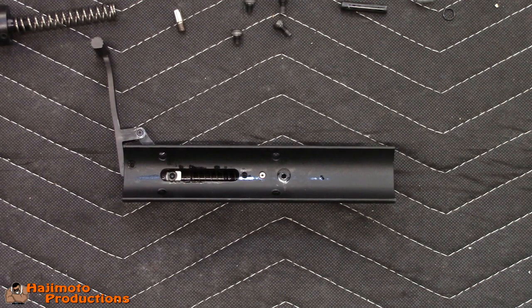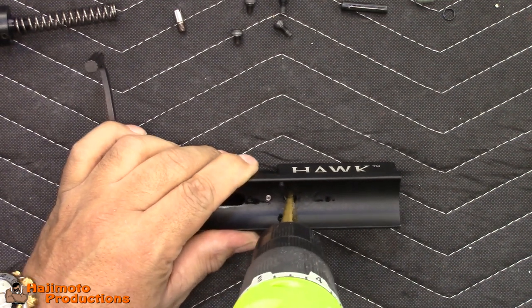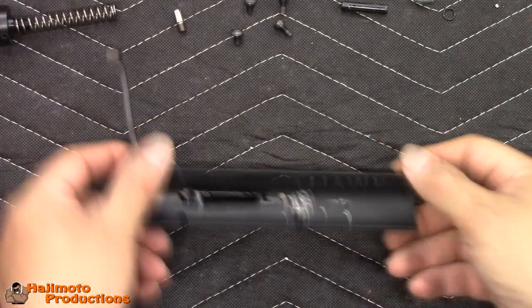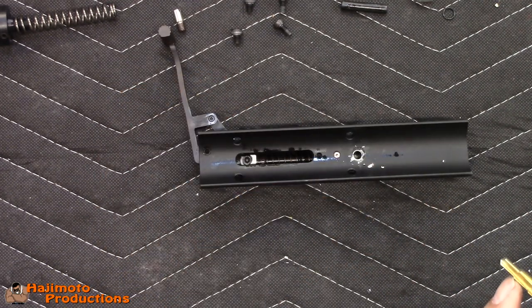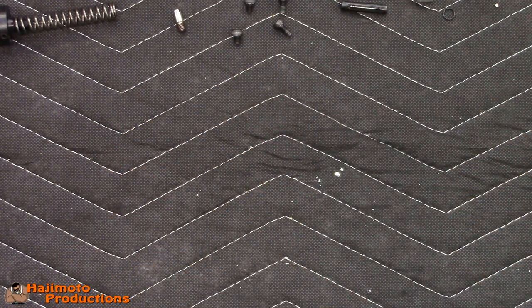I'm going to chuck up this drill. And as you can see, that's a fairly lengthy 3/16ths. We've got it ready to go, chucked up. I'm going to use it on slow speed. At the center I'm going to simply drill that hole out as straight as I can — just keep it straight and drill that to 3/16ths. Okay, we just popped through. And then I'm going to take this, because it shoulders up to a quarter of an inch, and all I'm going to let it do is deburr that edge so that we don't have a rough edge there.